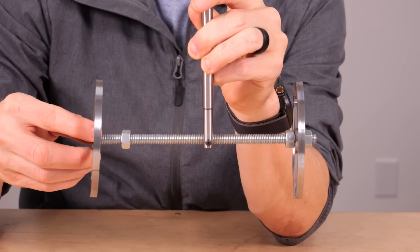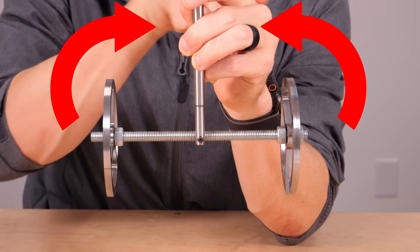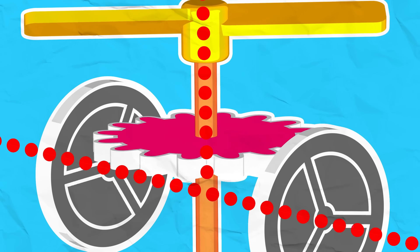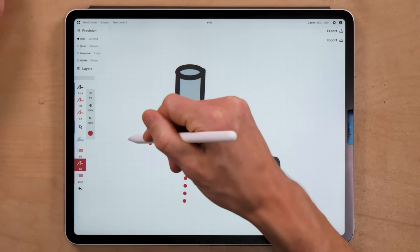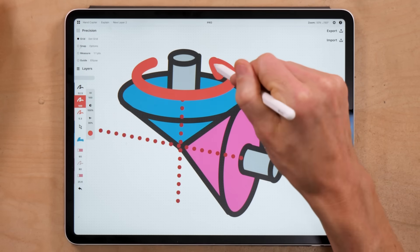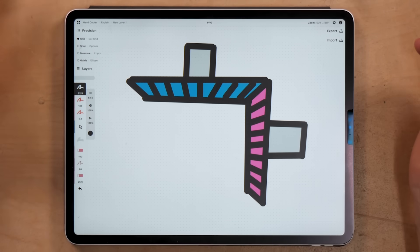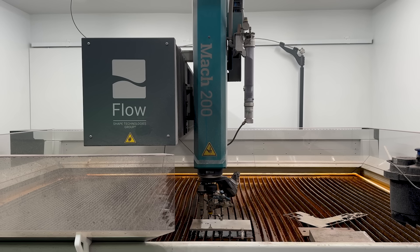The trick is to put a second flywheel on the other side of the helicopter spinning in the opposite direction — it'll precess in the opposite direction and cancel out the twisting. The last question is how to connect the flywheels to the propeller. I decided to use bevel gears. Imagine the flywheel shaft and the propeller shaft, draw two imaginary lines to where they intersect, then make two cones from that point to each shaft. The cones touch, and if one spins so does the other. Delete the cone tips, add gear teeth, and you have bevel gears — which I have to make myself to keep them very light.